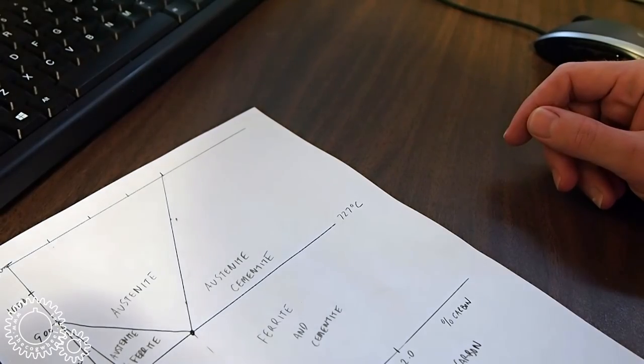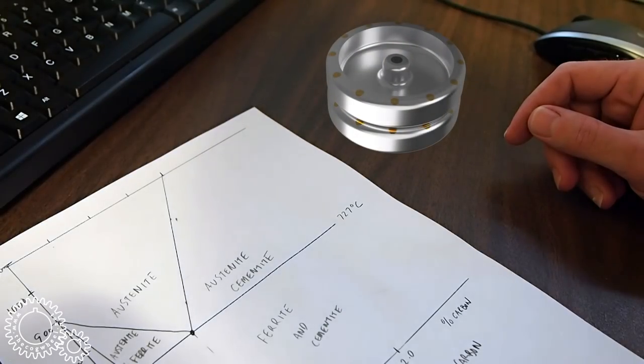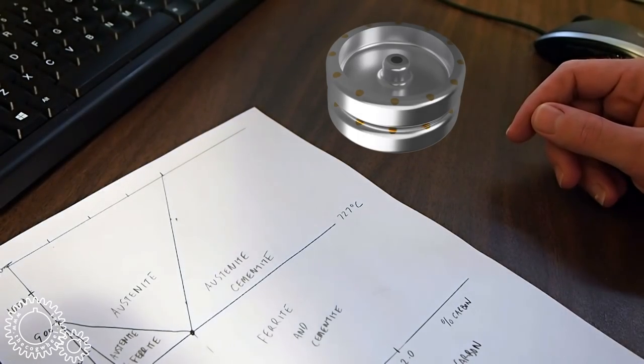I have a project coming up that I'd like to use an OD radius cutter on. Normally I just file the radius in the lathe and cut out a little paper gauge, but I'm making a number of these and I'd like to make sure the radii are matching. I'll also be machining aluminium, so making a radius cutter isn't a big deal.